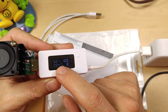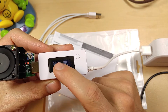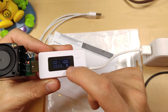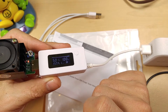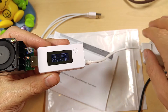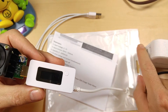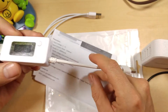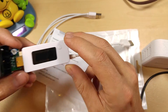You can see that our mAh is automatically going up, and the 8 right there stands for memory slot 8. If we did go outside of our 4.5 or 5.5 volt safe limits we would get an indicator on the screen. To test a cable, you would compare this value to the value you would get if you plugged a different cable in between. If you got a really huge difference between the two readings, you might have a bad cable.